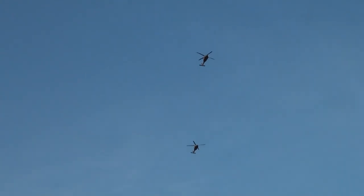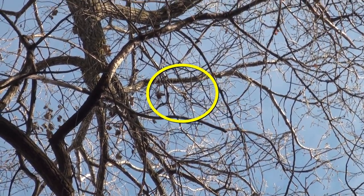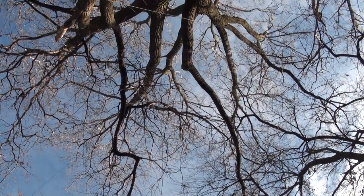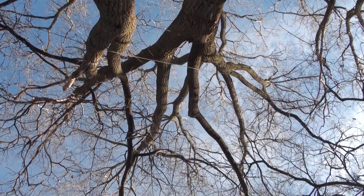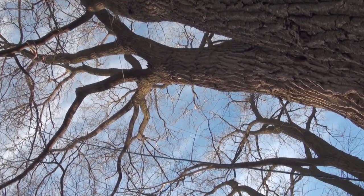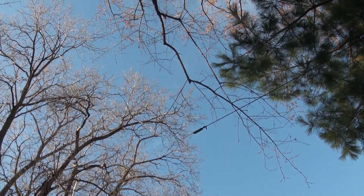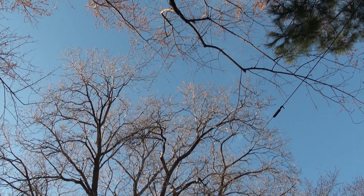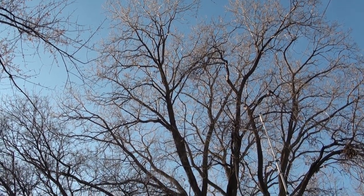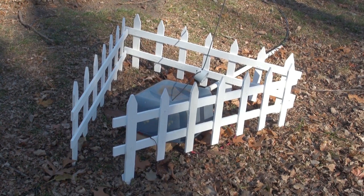Not a good sign — put up an EZJ and they send the black helicopters after you. If you look very closely in the center of the frame, you can see the bottom end of the inverted J. I leave quite a bit of slack in the support line for the bottom end, just in case there's any movement up there. Trees are not stationary, they move — so keep that in mind. One concern I have is that a tree branch could catch this support line and tear down the antenna. However, here in the suburbs when you want to work top band, everything's a compromise. The fact that the inverted J is more vertical than horizontal might make it a little bit less susceptible to those problems compared to the 80 meter dipole, which has been damaged and knocked down by tree limb failure multiple times over the years.